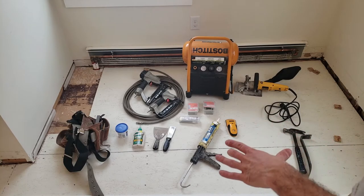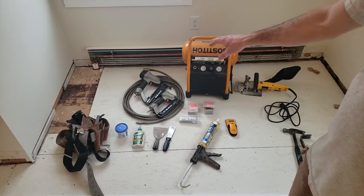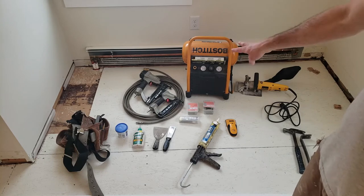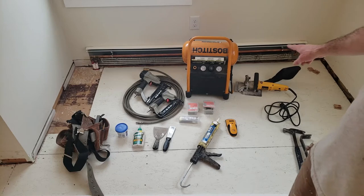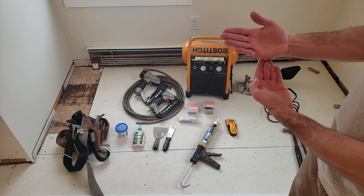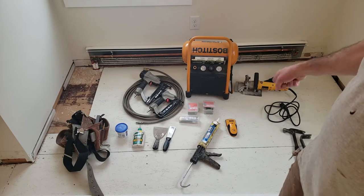So I think I've gathered everything we're going to need here. You're probably going to need a compressor and some nail guns. You can nail with hand nails if you don't have these kind of tools — you don't need to go buy them, it just takes longer. I'm going to use a biscuit joiner. That's not necessary, but I use it on the top of the door casing so that those joints stay good forever — I'll explain that when we get to that. You're also going to need a stud finder so we know where the studs are and can nail directly into them.